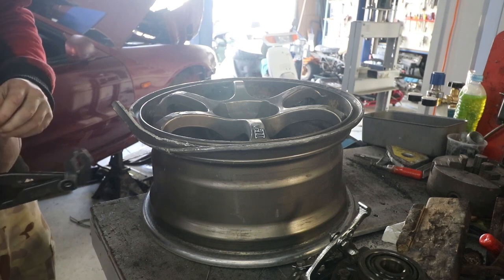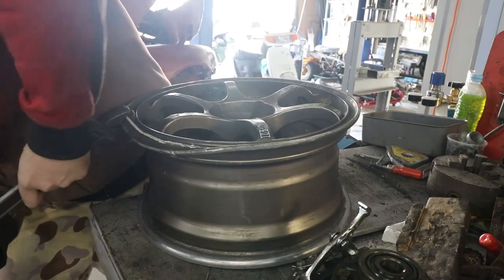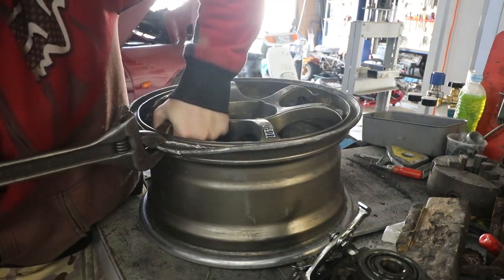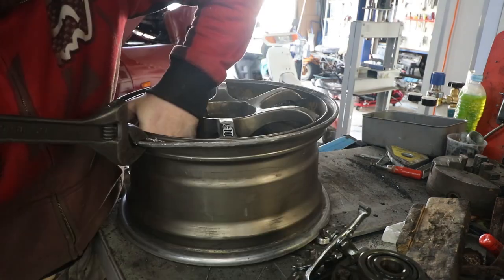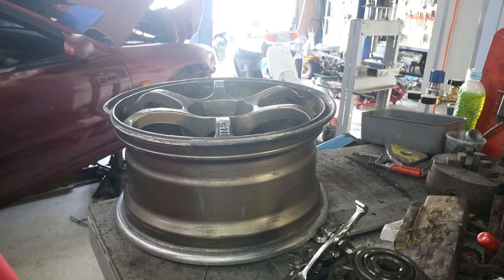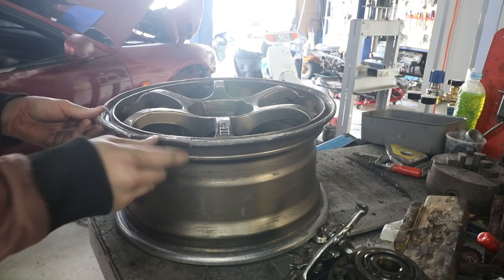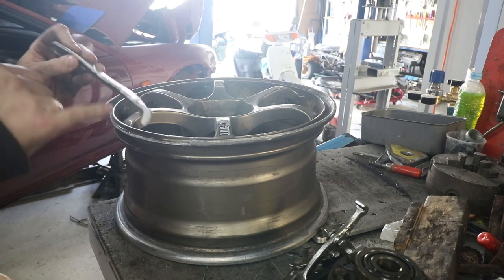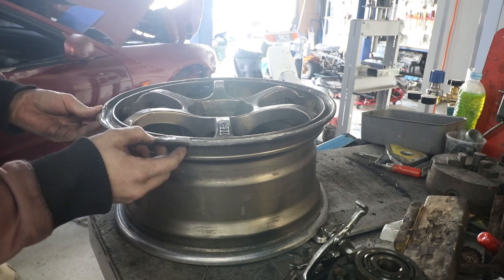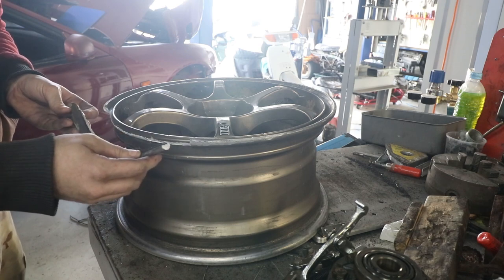It's harder to bend than I expected. I had a feeling that might happen, but that's okay. My plan was if this cracked and came off — which it has — I can now try to straighten this separately. And if I really needed to, I could make this piece from scratch, which I want to try and avoid. But it looks like bending it with the spanner it's getting pretty close. So I'm just going to keep working this piece with the hammer, maybe try to squash it in the press a bit, and then we'll move on to the next stage.